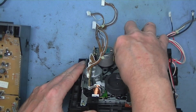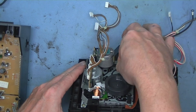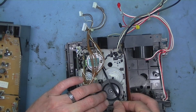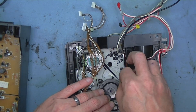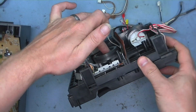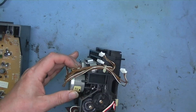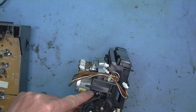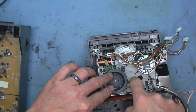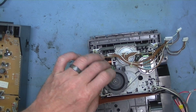I'm going to loop the new belt onto the spindle, then pull it around the capstan flywheel. Then just turn the belt to make sure it centralizes itself on both pulleys. You should be able to see from through there that it's lined up. That's all back on now and it doesn't feel like it's going anywhere - nice and elastic, which is what we really like to see.